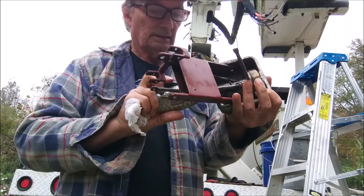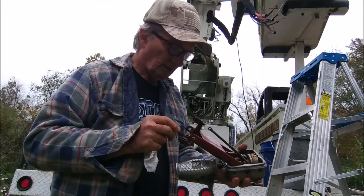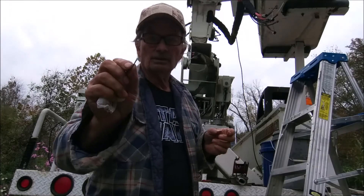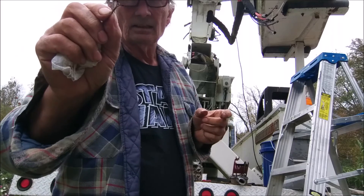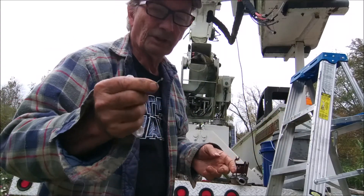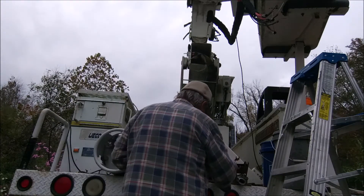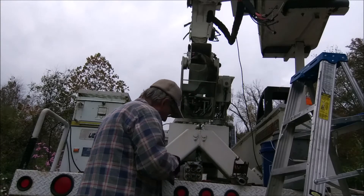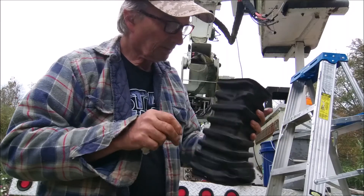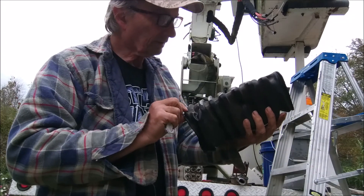Those are all the levers that either open or close the valves. These are the cotter pins — just re-straighten them and reuse them to reconnect the six valves in the body, rather than buying a whole pack. In the boot, you want to locate the small hole that the airline is threaded through as you reassemble it. Most of that is just to keep moisture out, but it didn't do a good job since the handle was all frozen in place.